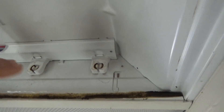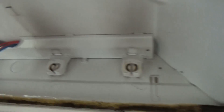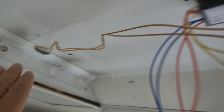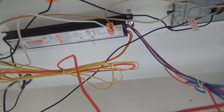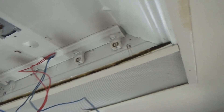What I did was move the red and blue from one ballast to these two lamp connections. On the other side, I moved the yellow from this ballast to these two connections. I completely removed the misrouted set. We're just testing one side right now. I'll replace the bulbs, turn on the switch, and see if that works. If not, we'll figure out the next step.